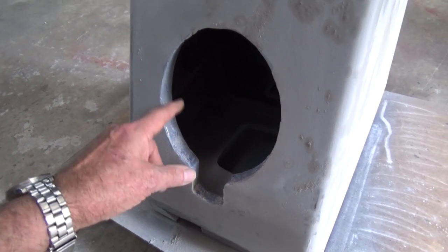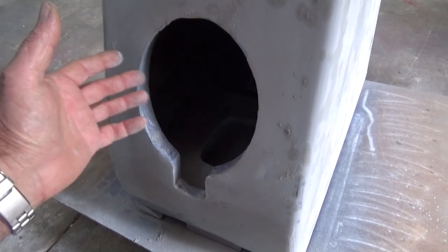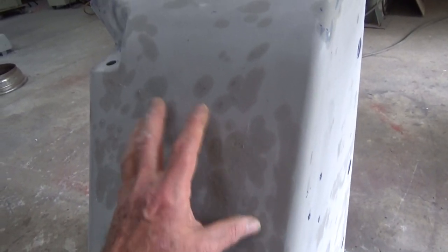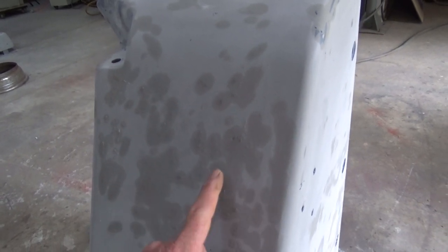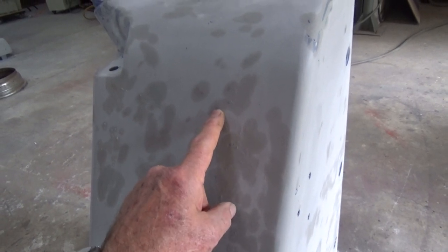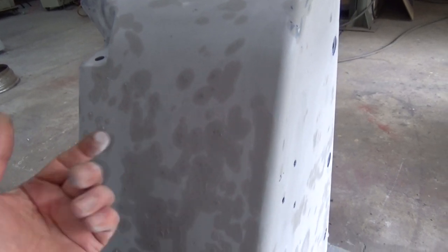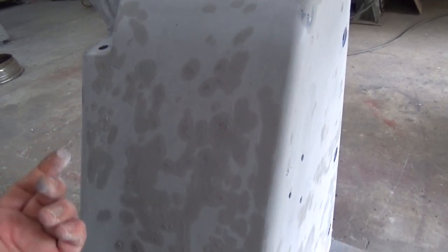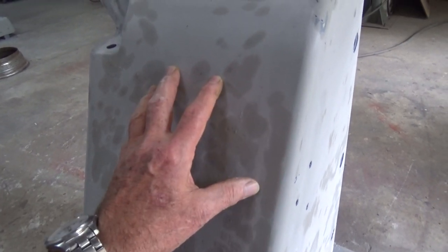And I hit that with a pressure cleaner and washed everything out of the inside of it. I sprayed it with detergent. I scrubbed it before I started any of this process of putting the paint on. But the oil has just simply seeped straight through that epoxy coating. Now, that really surprised me because it's an epoxy paint. It's a thermosetting resin. It should form an impervious barrier, and yet the oil has come through.